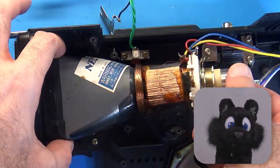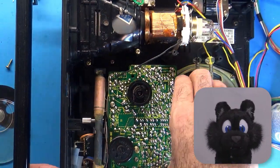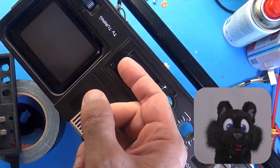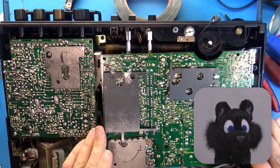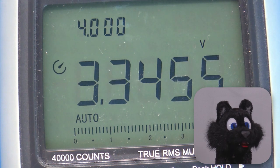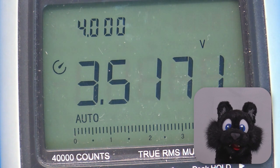Turn it up. Well, the tape deck works, like before, but no radio, no TV. Just plain nothing. Let's check the voltage on the supply cable running from the mode selection switch to the TV and radio part. About 3 volts only? It was either 9 or 12 volts internally, but not 3.